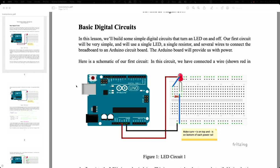Electronics use direct current, and the convention for this is that we say that current flows from positive to negative. Okay, and the convention on color coding for this is usually the positive is indicated in red and the negative or ground is indicated in black. Anybody ever jump started a car? Same thing, right? The positive terminal, you know which one's which, other than the labeling, because it's red and then the other one is black.